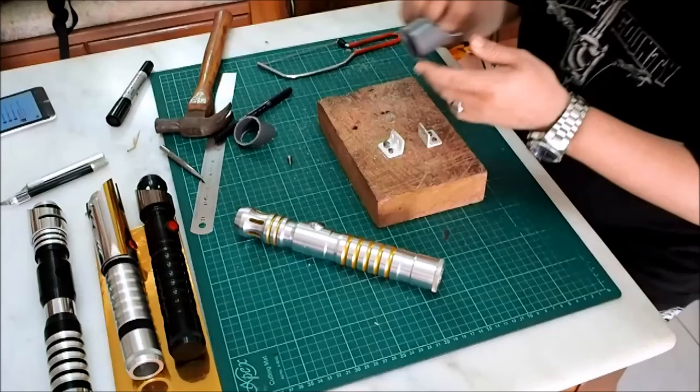Just now I made a center punch here. Now I'm going to drill a hole through here. That hole must be the same size as the set screw. Okay, as you can see, I've already drilled a hole here. This one will be the same size as this thumb screw, which will be used to hold the shroud as well as the blade in place.